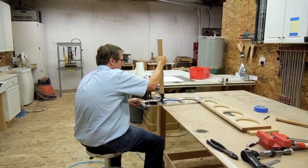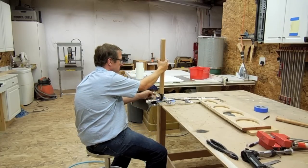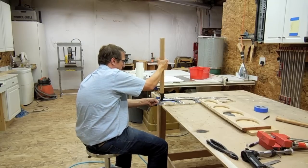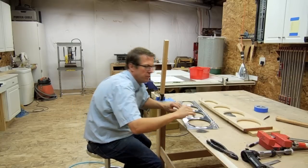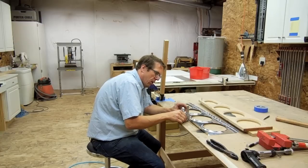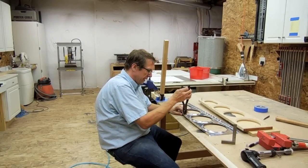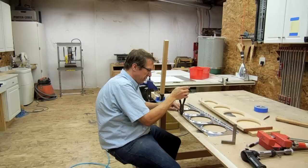But because of the angle, it's really pushing the bottom in. The top of this is probably offset from the front when I'm pulling it, about an eighth of an inch. So it's not really pushing much on the flute, unless there's a heavily fluted area. So now if I was to look at it with my square, these are almost right at 90 degrees now. And we're going to go and then flute this a little more, reflute it, get it down flat. And we'll check it one more time to see if we need to do any straightening.